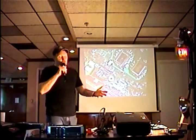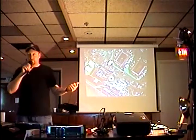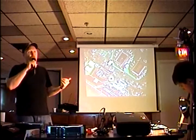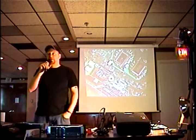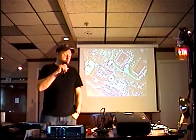Once you've soldered it and it's complete, go ahead and put it back in the Xbox. Now, this is a part that really sucks if you're bad at soldering. If you mess up the point that's on the bottom of the board, you've got to take it back out of the Xbox. So that's another reason why, if you're not really good at soldering, you may want to choose another option if you have a 1.0 or 1.1 Xbox.